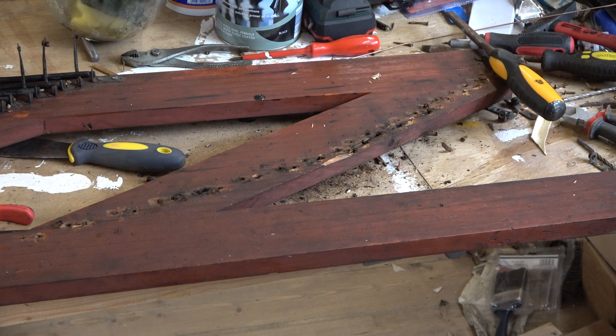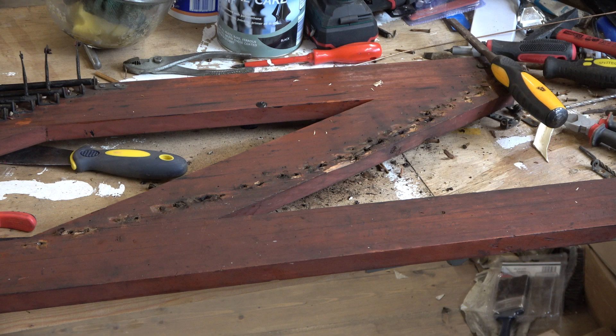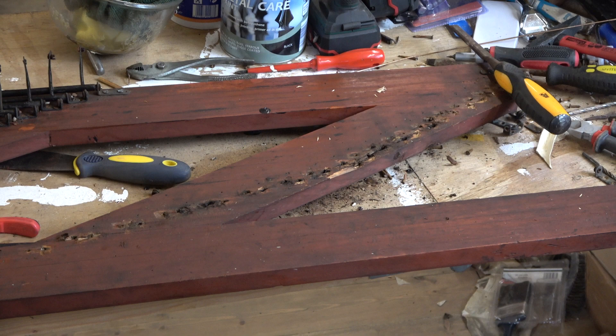This end was against the window in the church and things are absolutely dreadfully rusty at this end - we knew this, having had to cut screws out of the framework. As we've gone along, most of these screws came out fine, but then they've had to be either forced out or drilled out. Very few, when we get to this end, could be got out any other way.